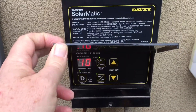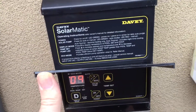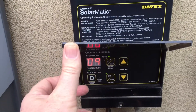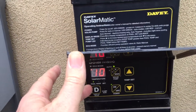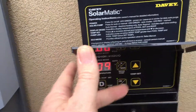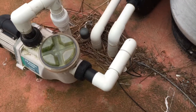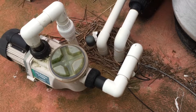You've got the temperature set so you can determine what temperature it'll turn off at, so the solar doesn't take your pool too hot. You've got manual and auto buttons, on/off, and this one here has a digital display to give a readout of the roof temperature, the pool temperature, and the set temperature — so this is a bit of a fancy one. That pool temperature will only be accurate when you're actually running the pump, because it's a temperature sensor right here at the front of the pump, so you have to put it onto manual if you want to check exactly what your pool temperature is.